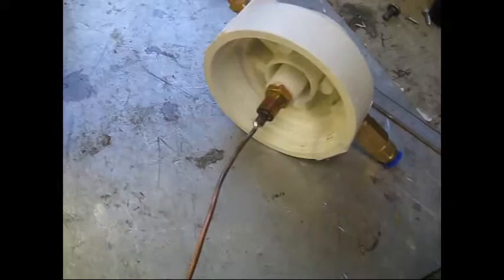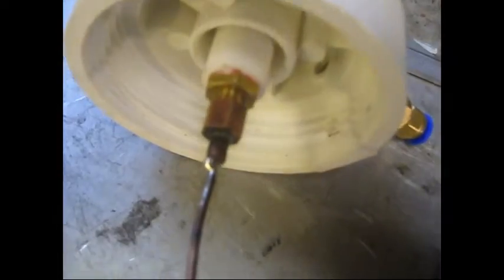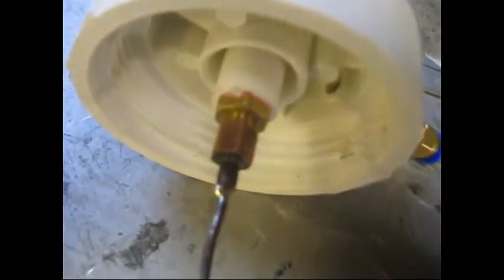This is what it looks like from the inside. That's some three millimetre capillary type copper tubing, soldered into an adapter that goes to a three-eighths of an inch BSP male fitting, male to male. Luckily it fits really nicely inside the top of that cap where the filter normally goes in, and because we're pressurising it it's unlikely to leak, and if it does leak it's no big deal — it's just going to go out where we want it to anyway. So I've soldered the capillary pipe inside that, sort of adapted it from two different sized bits of pipe.